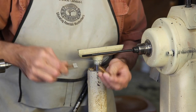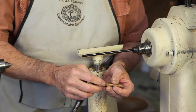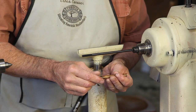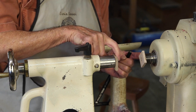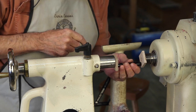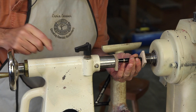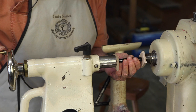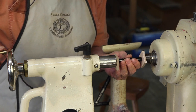And we are now ready to press our pen together. Most instructions tell you to do this in a bench vise or a pen vise, but I'm actually going to use our lathe to do this task. Your lathe also makes a great arbor press. I've double-side taped two squares of wood to the spindles. I took a pencil and drew a little circle, which gives me the center, and I can just put that right there and bring this up and press the two together just as nice as can be and have complete axial alignment throughout the whole process.